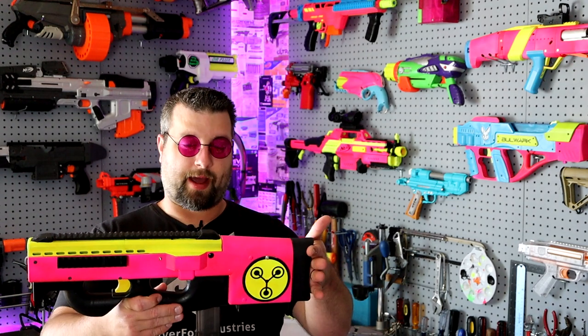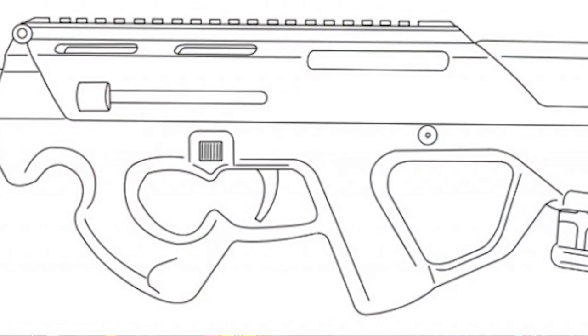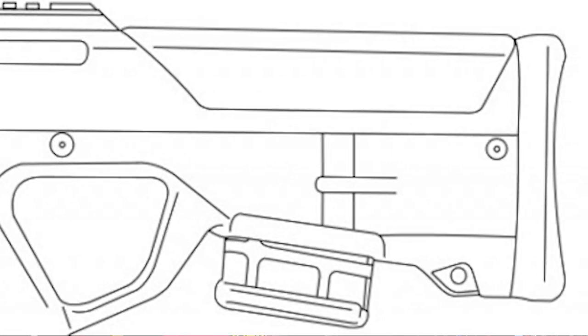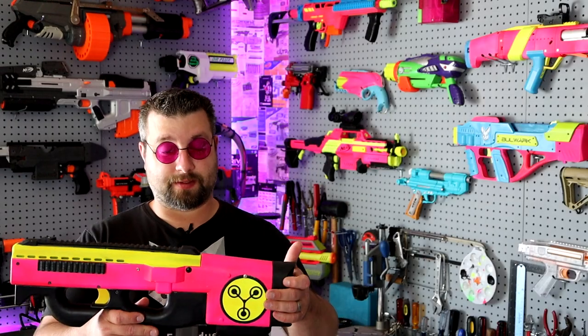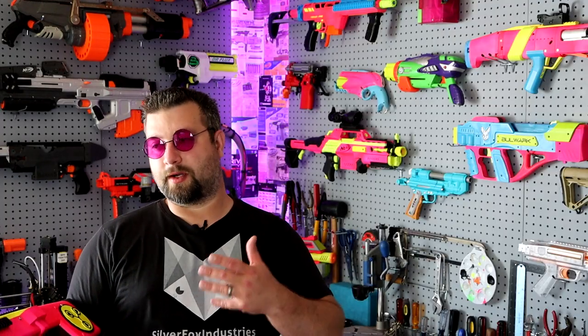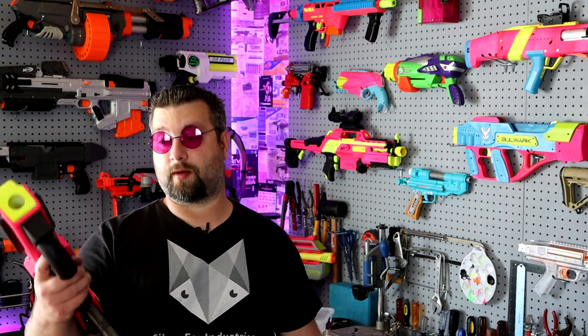And I think it would probably have kind of a feel like this, maybe more in line with what the actual Magpul PDR looks like. I'd probably just lean more into those design choices because I really like that thing. Overall, the FPS numbers were spot on for what I was looking for. The crush inside here is not too drastic, so that's why we can get the consistent 110 to 120 FPS range, which is perfect for what I want to use this for. It wouldn't be too hard to add a little crush in there and get higher numbers.